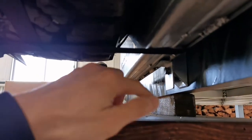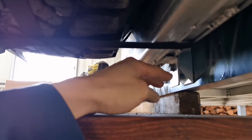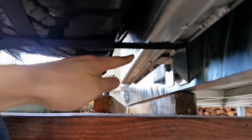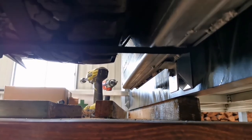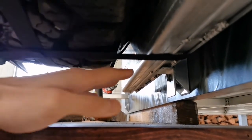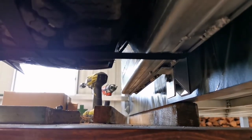So what I'll be doing, I'll make something a little bit more heavy duty, probably around 4 or 5 mil. And it basically goes out here, forms a little concave surface, and then maybe goes up here, and then it goes back down. So when the tire comes back, the arm comes back, it hits this gradient, and then it sort of slides up, and then it fits into the concave surface very nicely. And that way, it is another way to lock this arm in.